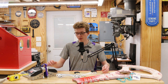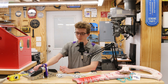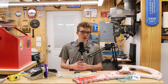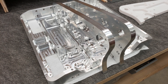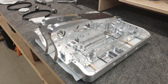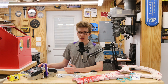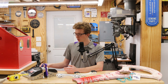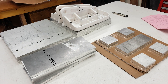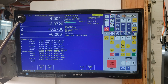Starting at the beginning, Kaleidoscope V2's design is a lot different from the first two versions that competed earlier this year. The whole base of the robot has changed from being constructed out of welded aluminum to now billet and machined aluminum. I have the ability to machine aluminum in-house on the Bridgeport, and this time we wanted to take full advantage of that with the new chassis. Kaleidoscope V2's chassis consists of a billet tub of 2024 aluminum and 7075 machined rails. The billet tub alone started at 28 pounds as a solid block, and I machined it all the way down to 3 pounds.